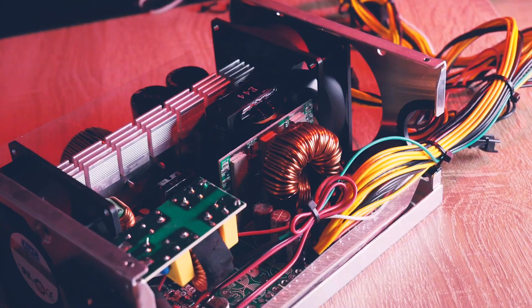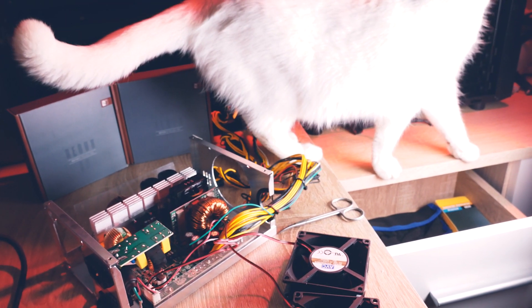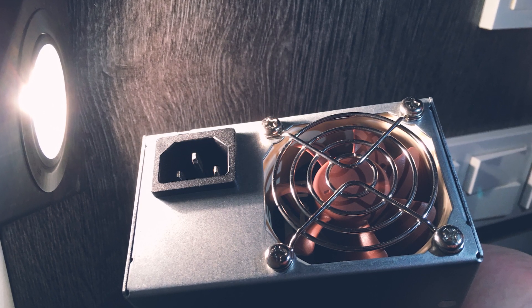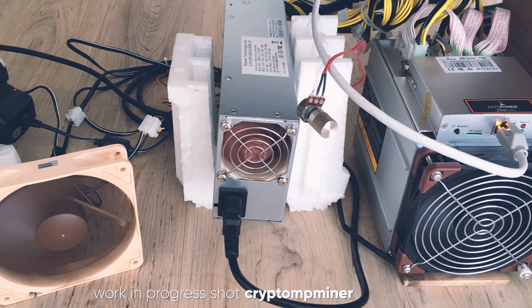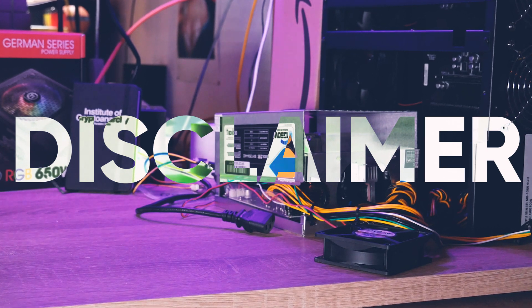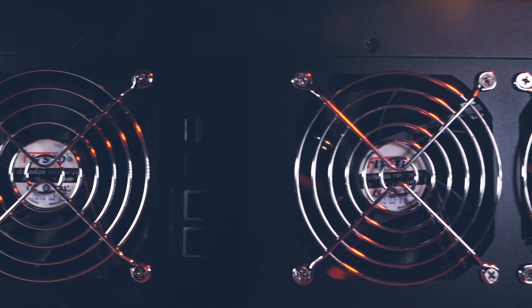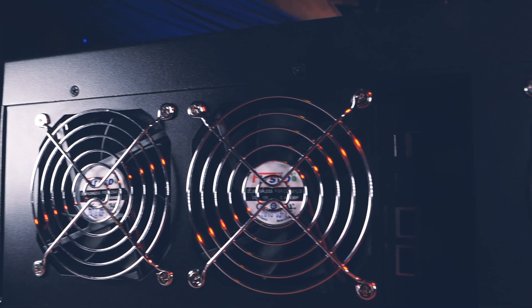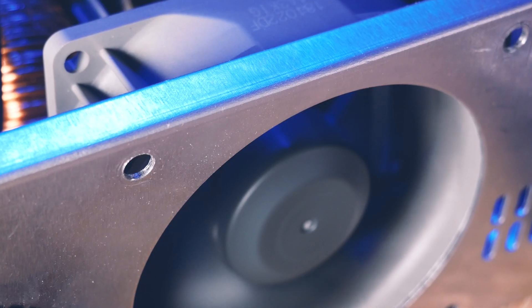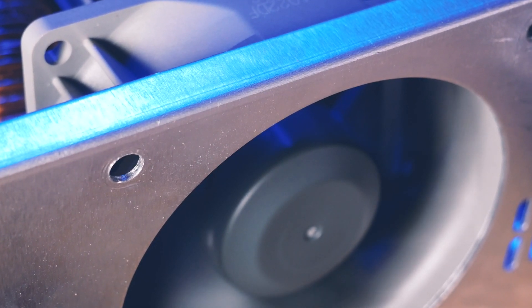First step is to take a look inside after opening it. It might or might not get finicky depending on your individual PSU - I've seen some with just glue all over the connectors and PCB, or simply closed off and soldered. Sometimes you are lucky and can just get the fan cable out to work with. For example, with Bitmain APW PSUs my friend Crypto MP Miner was able to reconnect cables. Please be careful - sometimes these Chinese PSUs are dangerous designs or simply crappily made. I myself am far from a professional with electronics, so please only do stuff like that at your own risk or together with someone who knows what they are doing.